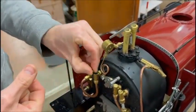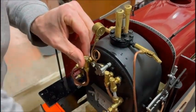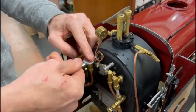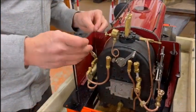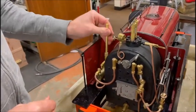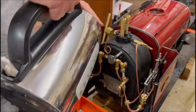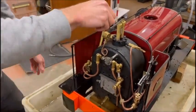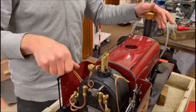You've got your ball bearing that you took out earlier — drop that in, put the lid on the check valve, screw that on nice and tight. Fill the water tank right the way to the top again and pop your pump handle on. Chances are you're going to get nothing out of the pump — all the balls are stuck. Give the pump a really good dousing with hot water. You can also give it a light tap with a hammer to release those balls, and suddenly the pump starts pumping. Fill the tank right to the top again and as the pump's working, you should see your level drop.